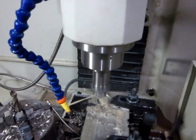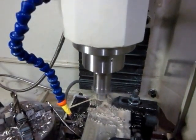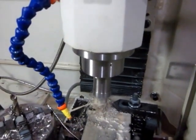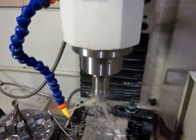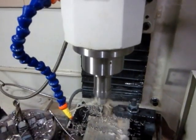I'm not sure there's a lot I can do to reduce the chatter on this material. The bore bars are just steel bore bars with an insert. I'd love to have a nice carbide bore bar or a heavy metal bore bar, but it's not something I have right now.